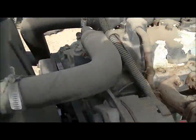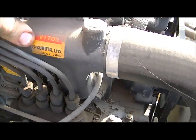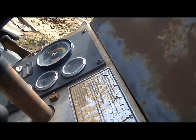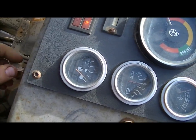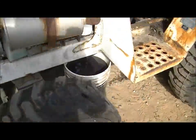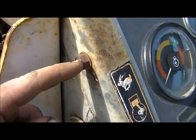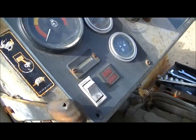Not really sure what that number 7 is for. Somewhere around here says Kubota — oh, there it is. It probably didn't have very many hours on it; it's just been sitting outside a lot. It runs very well. Looks like it's almost full on fuel, either that or the gauge doesn't work. The throttle goes into the red, so I'm going to have to loosen this bolt and back it down so it stays in the green — unless this is inaccurate, which I don't think it is.